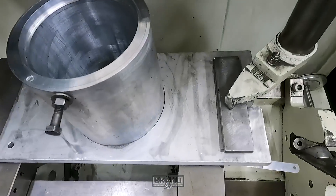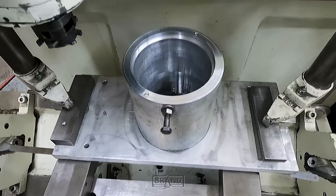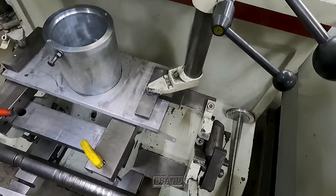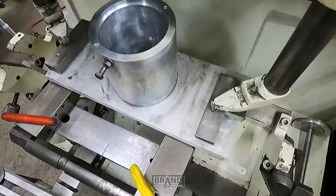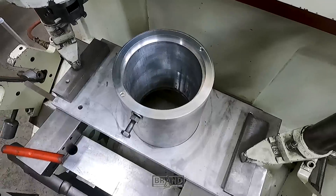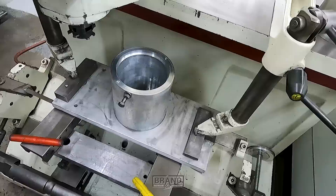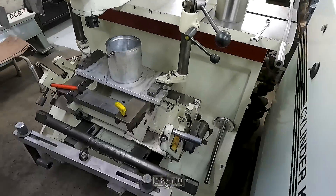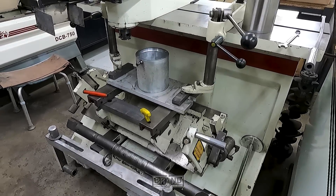I'll show you all this is a fixture I built to hold sleeves for these aluminum blocks where the guys have to change sleeves at the racetrack. Got a little bolt here that screws in and goes against the flats on the sleeves. I've actually bored this the same size as what the block is, so it'll have the same press as what the CN blocks have. That way I can bore the sleeve, o-ring it, and hone it.